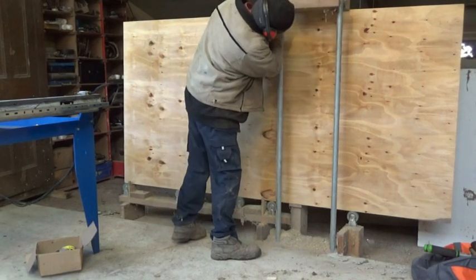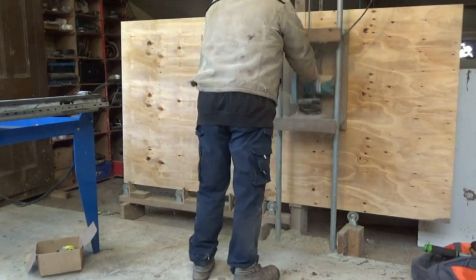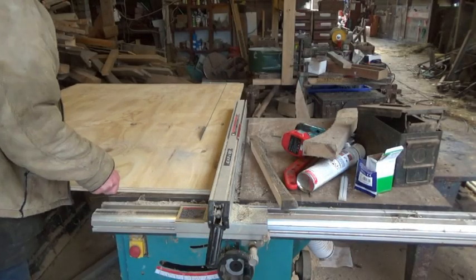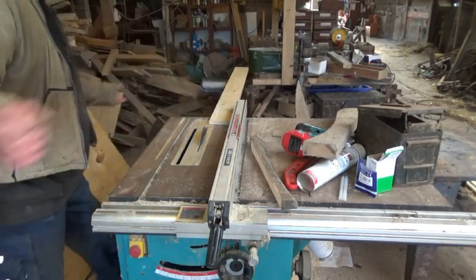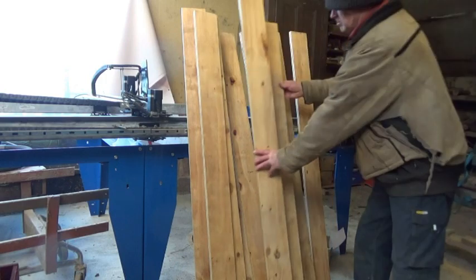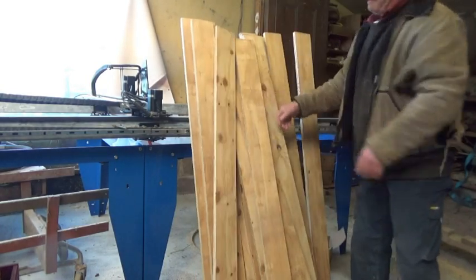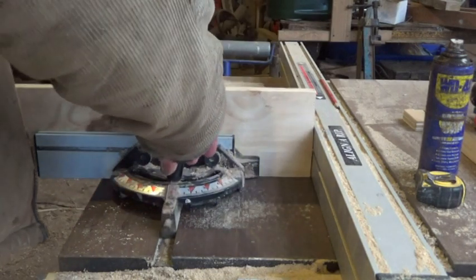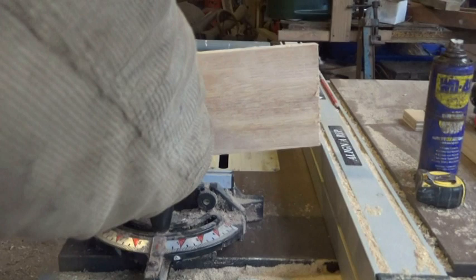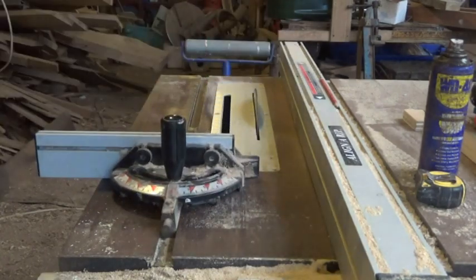He was very enthusiastic about the project. Now my plasma cutter has a metal grid as a bed, but a router needs a wooden base, and it needs to be solid and stable. I'm sort of guessing at a design for it more than anything, but as long as it doesn't move at all it should be fine. It's basically lots of cross ribs with longitudinal planks laid on top, and narrower versions on the bottom. I decided that the whole thing needed to be set down a couple of inches, otherwise it would limit too much the thickness of the material that I can cut. So I cut the bottom corners out of all the ribs.